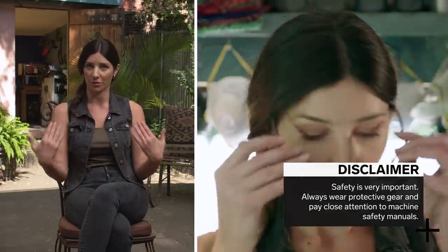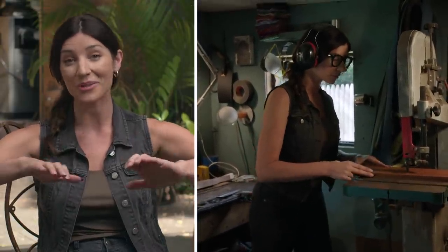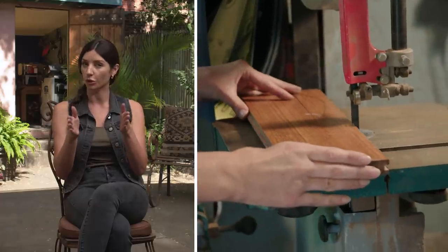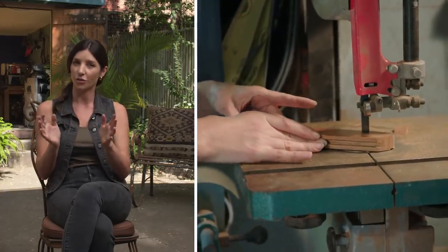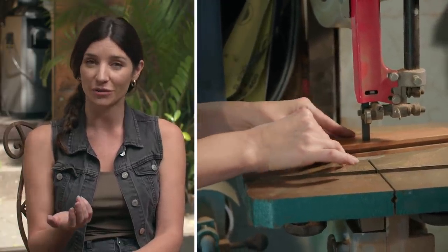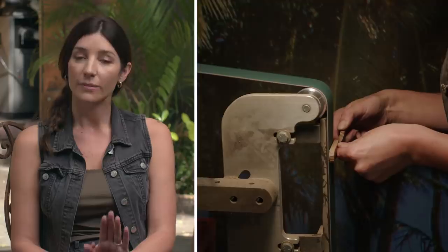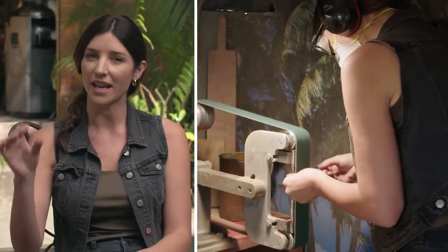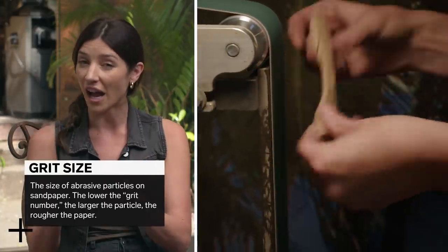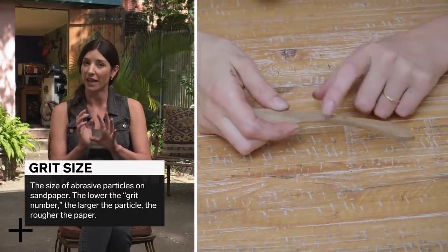Important things to remember when cutting out the shape is to keep yourself protected — protecting your eyes, protecting your ears, and making sure that your fingers are always outside the reach of the blade. Leave yourself a little room. There's no adding material once you've cut, so it's important to give yourself a little wiggle room and cut it a little bigger than you've traced. The worst thing that could happen is either you cut into the shape that you've traced, or maybe you go too deep when you're sanding it. The most important thing when sanding is not to remove too much material, because you can't go back. Start at a coarse grit and increase the tightness of the grit, so you end up with a very fine sanding of the knife.